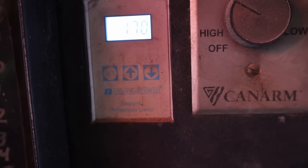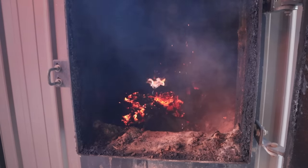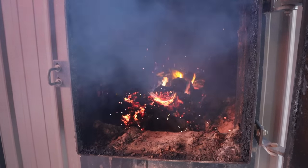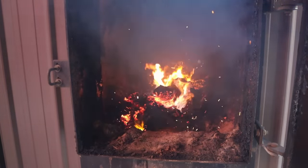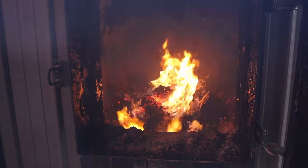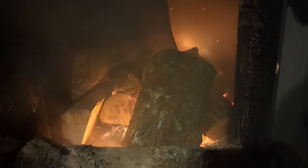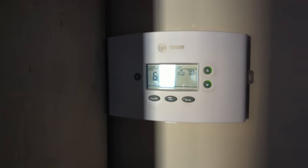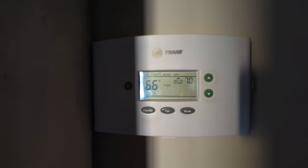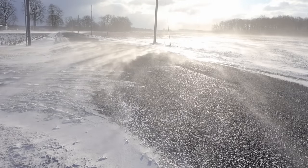When the water temperature drops below 170 degrees, the fan kicks back on, which provides oxygen to the smoldering fire and makes it flare back up. When it's really cold and windy outside, you want the fire to be able to recover quickly, so if you mix in smaller pieces amongst a few larger ones, you'll have a better chance for quick and easy recovery when the thermostat calls for heat. Without the smalls, it takes longer for those huge chunks to get going again, and in the meantime your water temperature drops. The more it drops below the desired temperature, the longer it takes to recover and you begin losing efficiency — instead of heating the house with the hot water, we're burning up a bunch of wood just to get it back up to temperature, and the cold and wind make it an uphill battle.